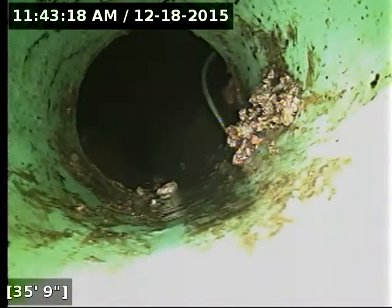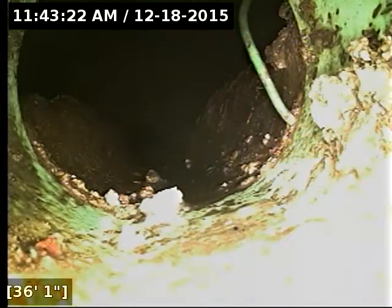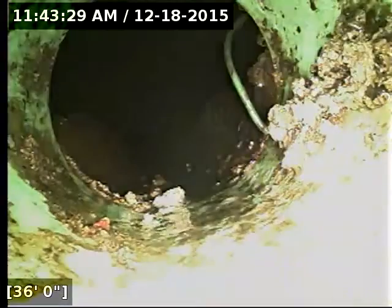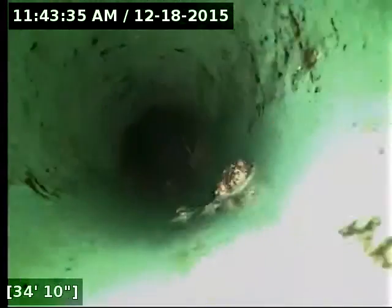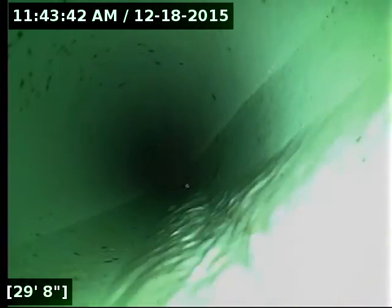You could talk to the builder, or the city possibly, to see what that is. It looks like it's intended to be there. I'm just not familiar with seeing that. It doesn't appear to really be affecting flow. I suppose that it could, if something got hung up on it, but I really have never seen that in about 4,000 houses I've scoped. So maybe we're checking into asking the builder what that's for.